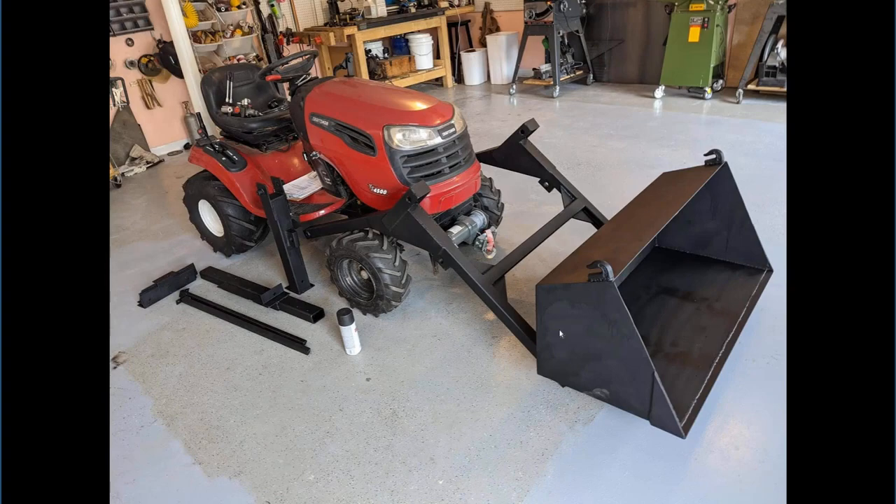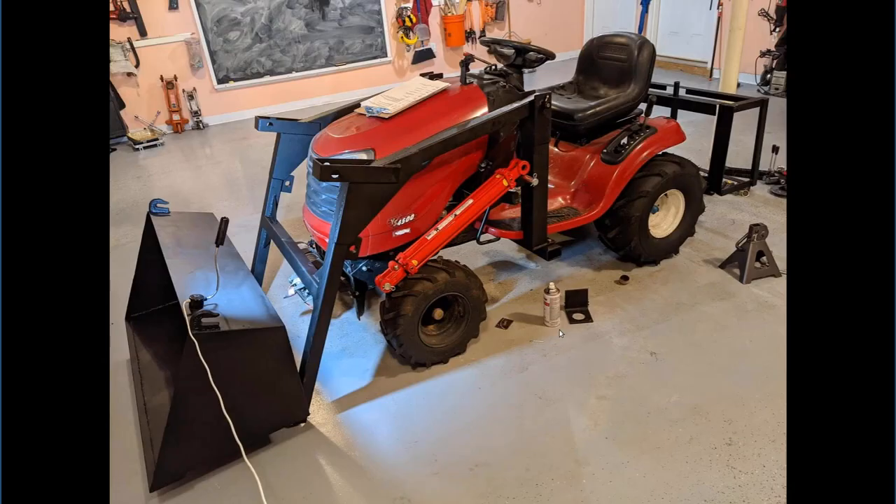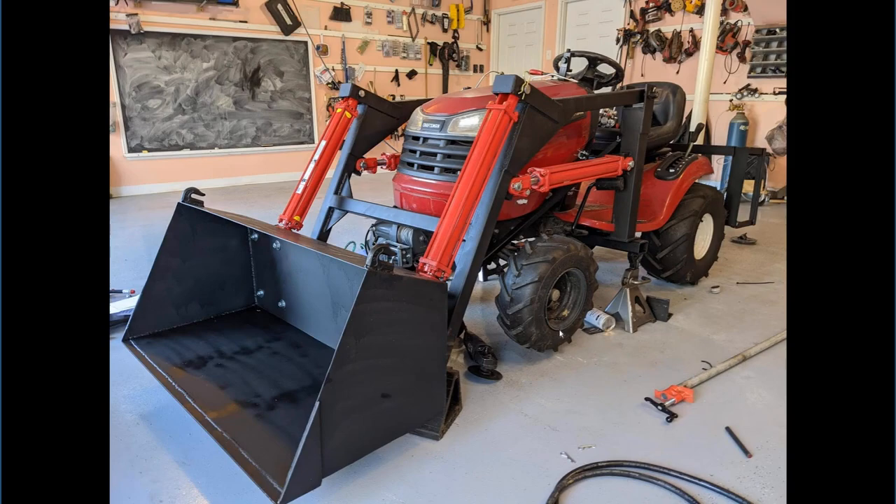Here everything is painted and ready for assembly. You can see the boom arms on, towers up, and the weight holder. Now I'm trying to fit up the cylinders. One of my big mistakes — I was off in my measurement and you see I have an extra pair of holes there. Since it's thin-gauge steel, 1/8 inch, I was able to use a step bit to get to the right size for the 1/2-inch hardware. Getting all cylinders to fit up right required the die grinder, because a little bit off on the apex of the towers ends up putting the cylinder off quite a bit down at the bucket.